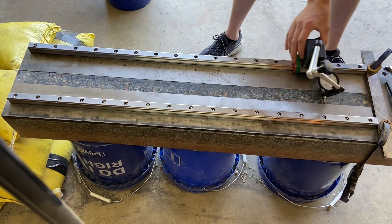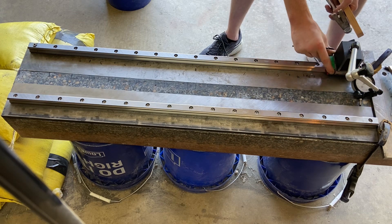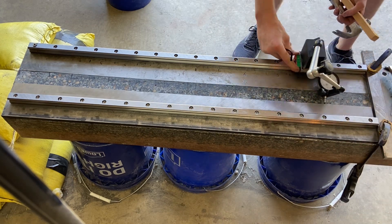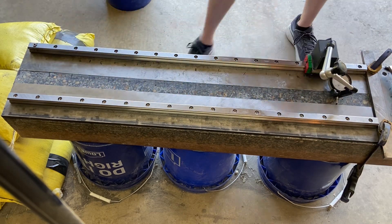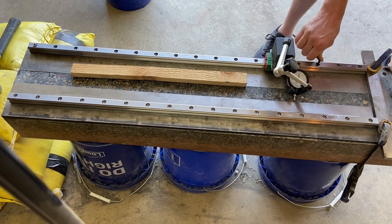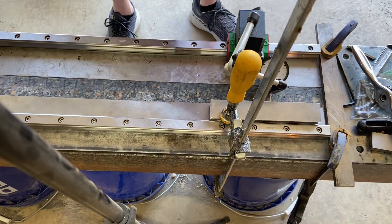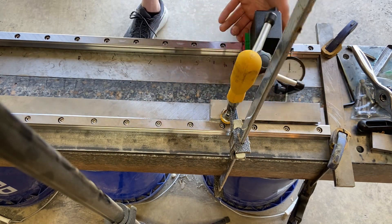And now here I'm taking my first rail — my master rail — and I've got it against a straight edge with the indicator, just trying to finish straightening it. It was out about 2 thou on the very end, so I'm just using that piece of cedar and slowly bumping it back and forth with the bolts loosened so I can adjust and get it fully straight.